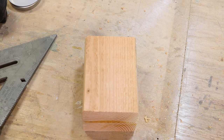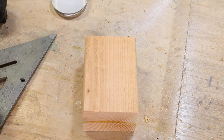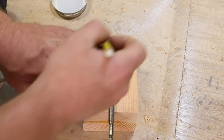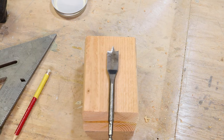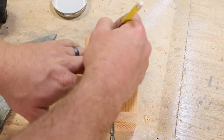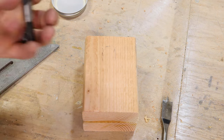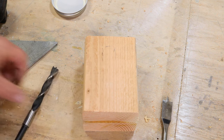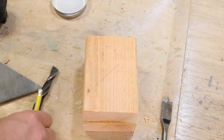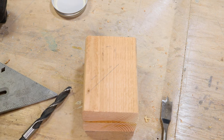The block of wood is ready. The next step is to attach the lid to the bottom, but first let me explain what we're doing. We're going to take our three-quarter inch drill bit and drill straight down about an inch or so from the end — put a little piece of tape on your drill bit as a marker for how deep to go. That will create a void going up through the block. Then we're going to take our three-eighths drill bit and drill in at a 45-degree angle on all four sides, up through into that main hole — creating a pathway for the bee.